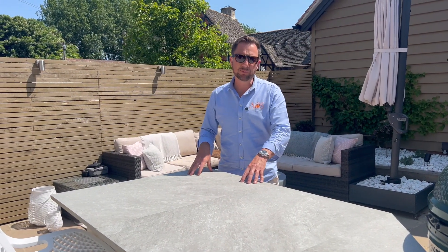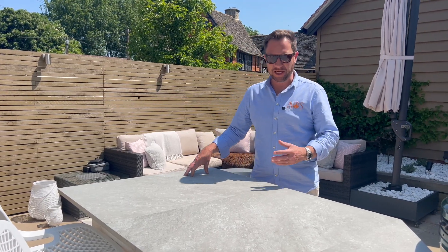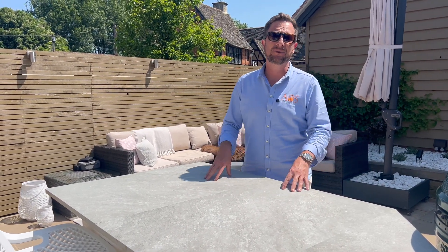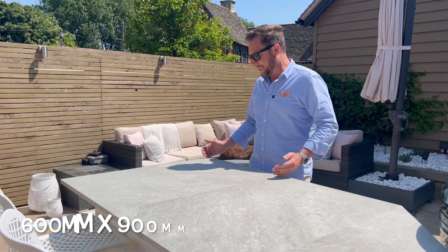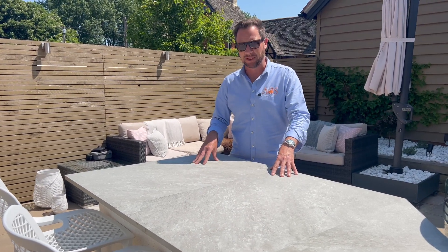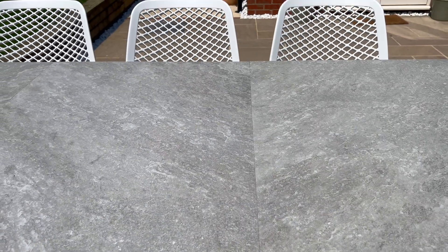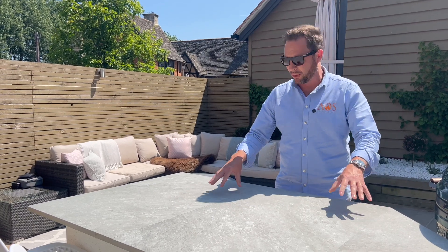So the worktops on these we have used porcelain slabs. When you're designing and building an outdoor kitchen, one of the biggest costs are the worktops — normally we would use granite or similar and it costs thousands of pounds. A really good alternative which will save you a bunch of money is to use porcelain tiles. These are the sort of tiles you would use on your patio floor. They come in lots of different sizes but the most common is 600 by 900 — two foot by three foot — they're 20mm thick and they're just really good for outside. The only downside is joins between each one, but the way this has been laid it's all butted up very tightly together, you can't really notice it, and you've got a really hard-wearing surface — you can put hot things on there as well.